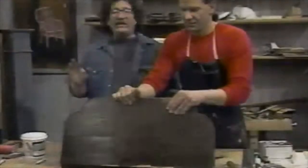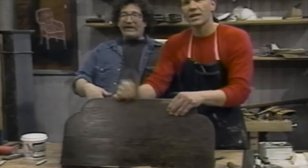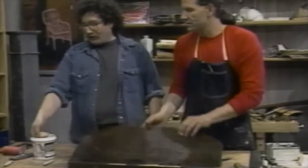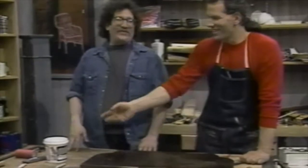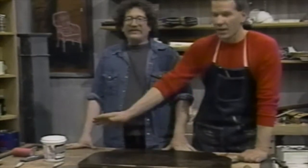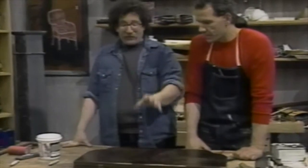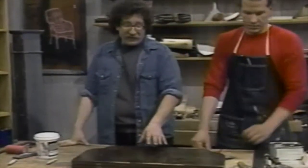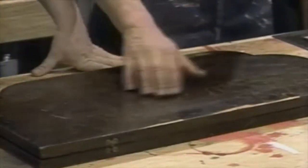On this piece, it's probably assembled with hide glue — the hide glue is holding the veneer on the top. This is actually made from horses, from the hooves. They used this kind of glue in the old days for adhering veneer. They would melt it down, paint it on, and then attach the veneer. Now, to activate hide glue, if you've got a small bubble such as we have here, you can reactivate it with a towel and a steam iron — put a damp towel on there with a steam iron and press, and you can reactivate it.